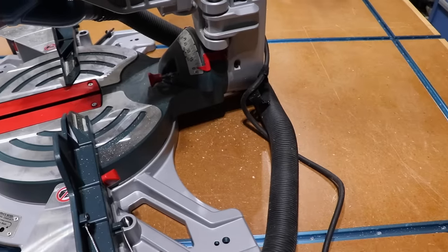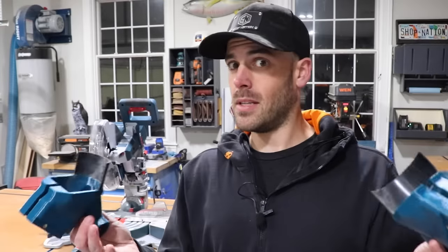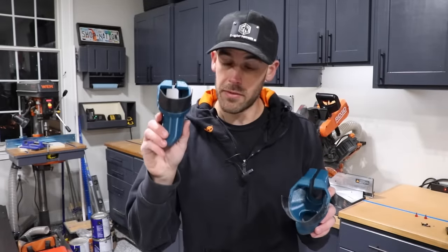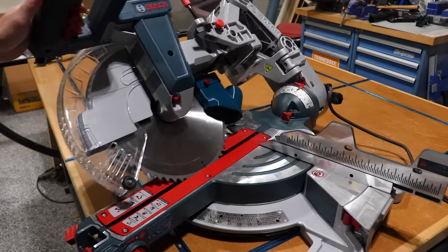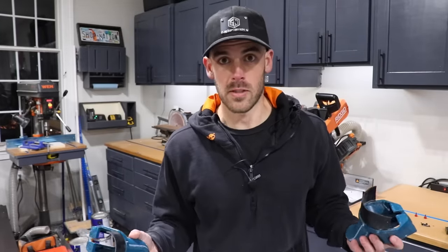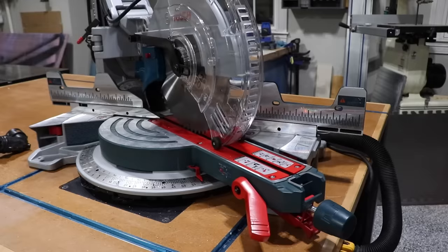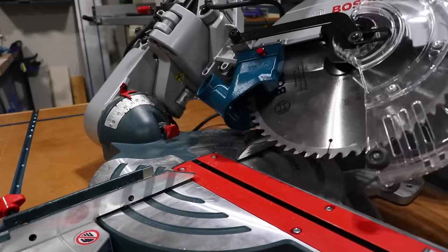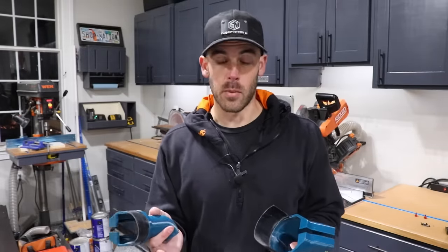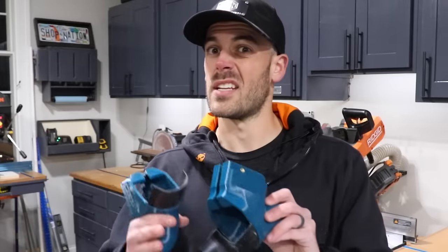After looking at the mess from that test, I was actually pretty surprised at the performance. I would have put all my money on the larger one performing significantly better than the smaller one, but it was a lot closer than I thought. However, after loading the saw and trying the sliding bevel feature at 45 degrees, I was getting interference even with the narrow one — meaning to truly get a full range of motion across all miter and bevel angles, I'd have to make it even smaller, which would cut down performance way too much. I then put the larger one in and tried the different angles: miters at 45 degrees both directions, no problem — I can even get to 60 degrees with full sliding motion. At a 45-degree bevel without sliding, no problem, but engaging the sliding action causes interference. So I'm making a judgment call: the larger version can achieve a 45-degree bevel in both directions, just not sliding bevels — and honestly, how many times are we making sliding bevel cuts? Sorry, trim carpenters.